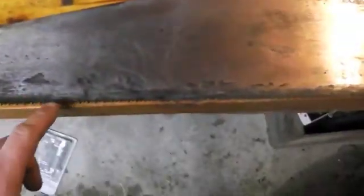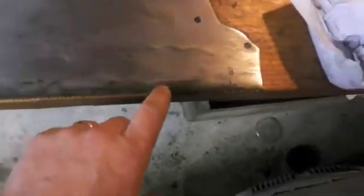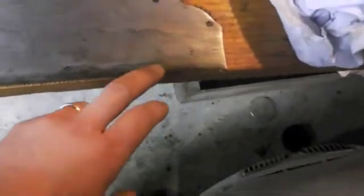The other thing to keep in mind is that when you're sanding down by the blade here, you don't want to run into these teeth, and that'll just rip the sandpaper right up as well as your sanding block. What I like to do is get pretty close to it but not go all the way up to it, and then at a later point come in and get a little bit closer and then finish it up just by hand with a small little piece. That way you're making sure that you're not removing any portion of the tooth itself. You're getting in close enough that it's cleaned up, but also you're not continuously running additional sanding over the rest of the saw where you might not want to.